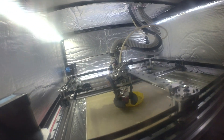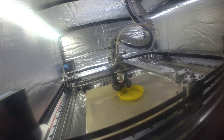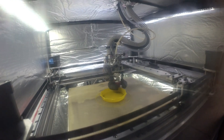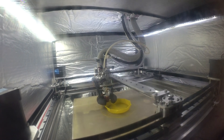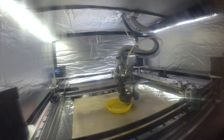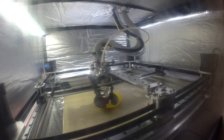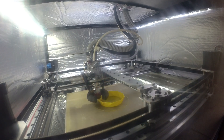That wheel is just spinning. I really can't flow much more than that with this size nozzle — there's not enough power in the extruder motor to push it. It'll do around 60 to 63, but it's not right. 50 is excellent — at 50 the lines look fantastic.